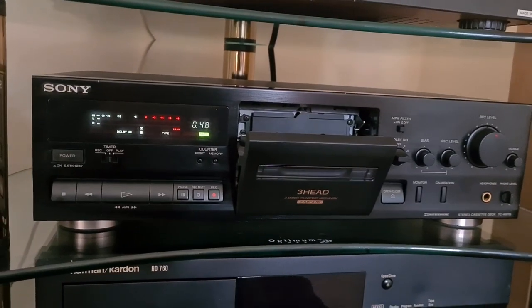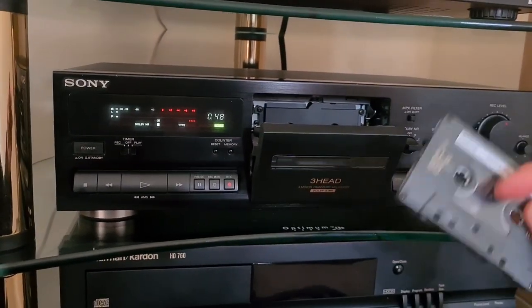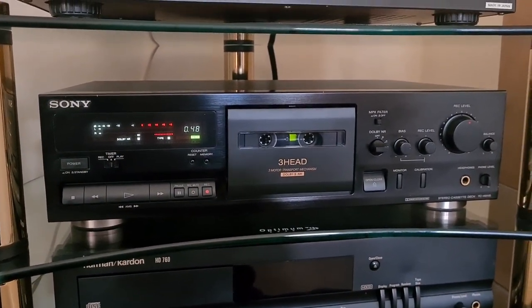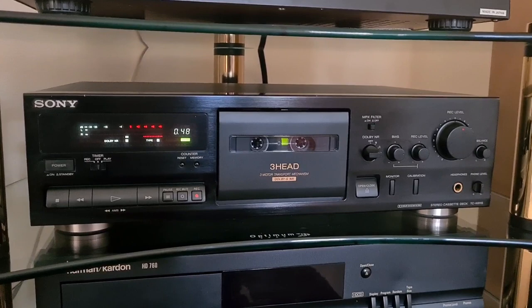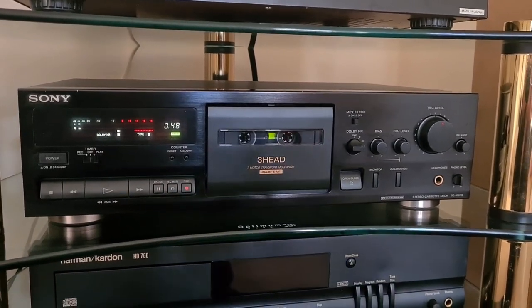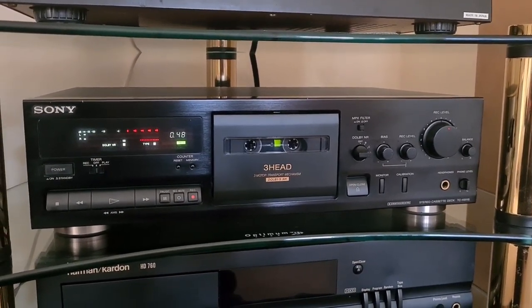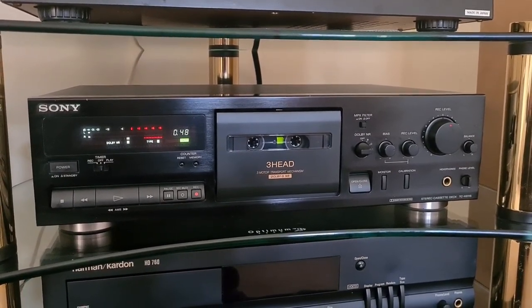It's a tiny bit up and down around 3000Hz but good enough for a cassette deck. I'm not going to mess about with the azimuth on this one because if the azimuth was off, the bias calibration would not have been working. The locking compound is still on the head. That brings us to the close of another repair video. Now there's only one thing for it — I'm going to put on some Creedence Clearwater Revival. I've confirmed it comes up as type two on the deck. Hopefully you've enjoyed this video, please subscribe, and I'm looking to hit a thousand subscribers. Have a great day!